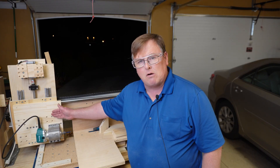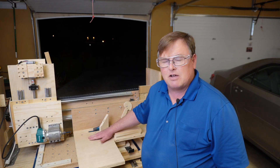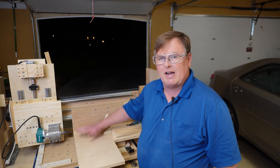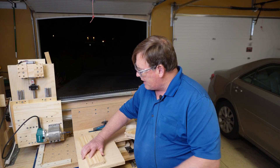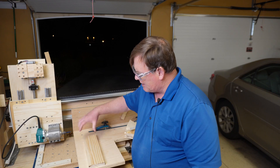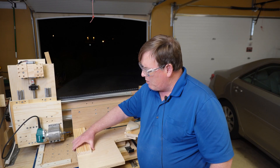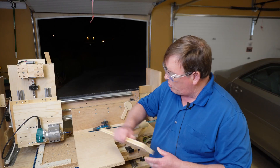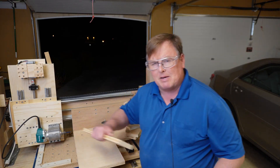Step one, you're going to be mounting your router sideways. Step two, you have to make yourself a platform that will elevate your boards. The way this jig is set up, I could mount boards out this way and flip the board over, and as long as I cut the mortise in the center of the board, I could cut more mortises on the other side. If I want to cut more in the middle of a board, I could slip thin boards underneath and actually go out the back of my CNC.